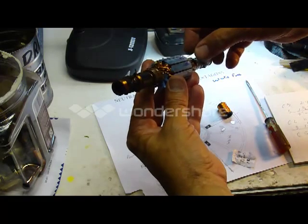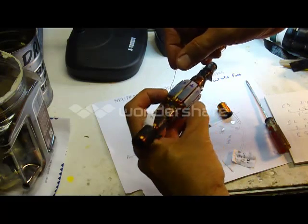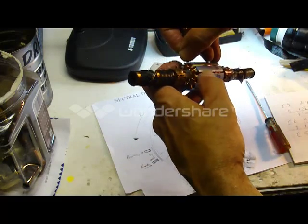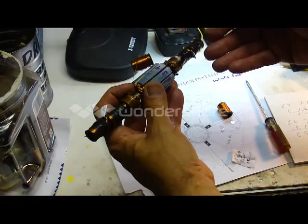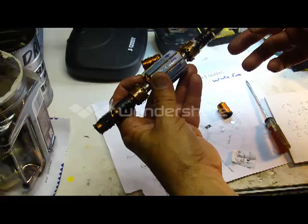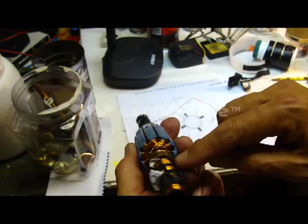Now I'm taking pole two south coil and I'm going to come around here. You can see I'm coming into four and five. We'll come in and I'll do about 20 turns — that's what it's taking. At any given time I don't have to juggle more than five wires using five spools using this method. You have to anchor these other spools as you wind; I've been just sticking them on the end of the rotors or the shaft. Seven south coils now from one through seven.